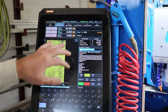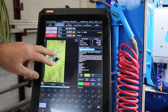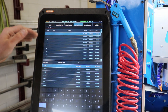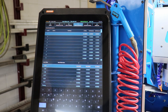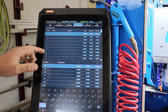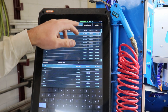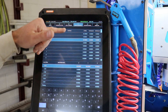If I go from 2D we just see a collection of lines; if I go to 3D you can see it's showing me that some of those are a lot deeper — there's a lot of overlap going on where it's hogging out more material through those Z moves. Under the F4 tab, this is where it's going to store all the offsets for the tools you use. We have it set to probe the tool every time because we're doing manual tool changes and there's no consistency in that tool height. When it goes and probes the new tool it will save that Z offset and use it for that entire cut, and when you switch back it's going to re-probe. If you're using an automatic tool changer, you could set it to just assume a certain height for that tool every time.